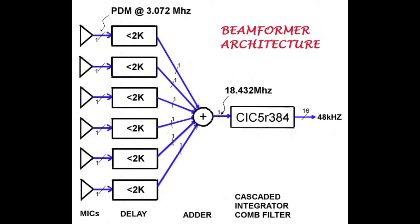From that, I want an audio signal at an industry standard rate such as 48 kHz, which is slightly more than double the Nyquist sampling rate for the best human hearing. This mono stream is fed through a cascade integrator comb filter of order 5, delay 1, and decimation factor 384. 384 is the divisor needed to produce 48 kHz pulse code modulation from 18.432 MHz pulse density modulation. The CIC filter is low-pass and provides the anti-aliasing needed prior to decimation.